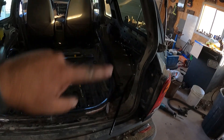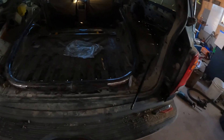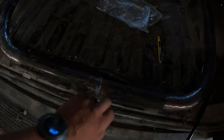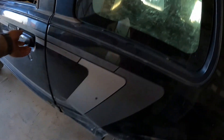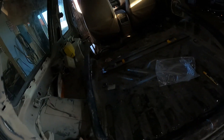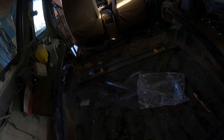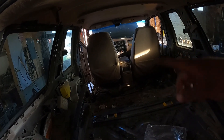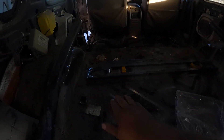I went and got some roll bar material — got a roll bar yesterday and got a little gung ho today. Instead of filming, I just got after it. It was secondhand, a little bit wide, so I had to cut it down and re-weld it. I got plates sitting in there ready to be welded in. I'm going to weld those plates in and then weld the bottom of the roll bar to them. I've also got some inch-and-a-half straight tube to go ahead and build some kickers. That hoop will go right behind the seat, and those kickers will come off and mount somewhere in the back, I'm thinking.